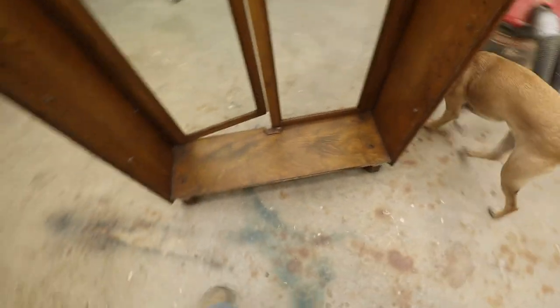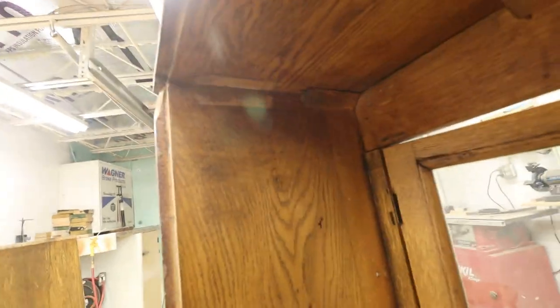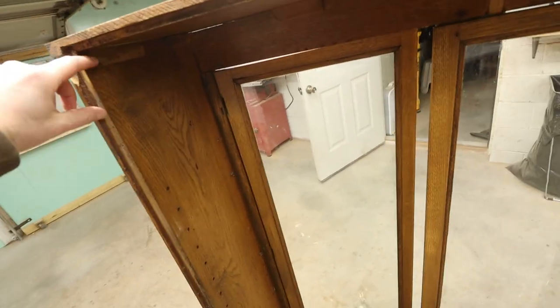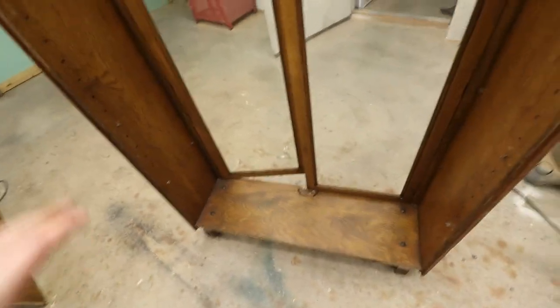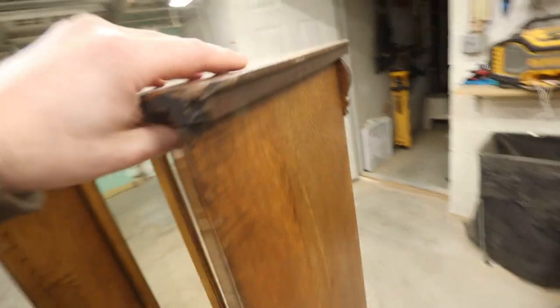Right off the bat, from building cabinets in the past, I noticed that with a big piece like this, there's a couple corner blocks up there - one came off - and that's not gonna do anything. So I'm gonna put some stretchers; I have some oak that would match this and I can color match everything. Probably about a three or four inch stretcher across the top and one across the bottom, and that'll make it very strong with no more wiggling. Plus this top looks like it's about ready to come off.